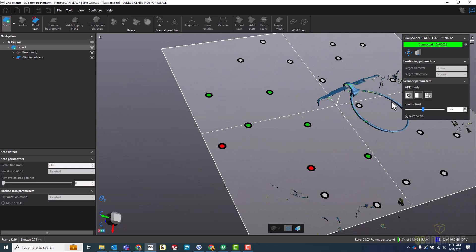We're going to just do an extrude cut of all of this. So now we have a nice clean profile. Exit sketch, use that to drive an extrude cut, again up to this surface. And there we go — now all of that face doesn't need to be supported. We have a nice little collar here for the tweezers to go into. This top here can safely be printed over because it's supported on both sides, so it'll bridge well. And same thing over here — it's a very narrow area, so we can avoid using any supports and it'll print over that bridge just fine.